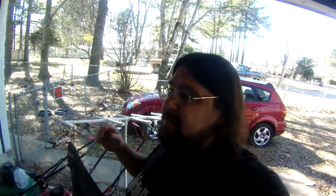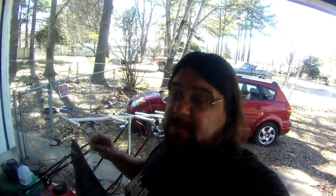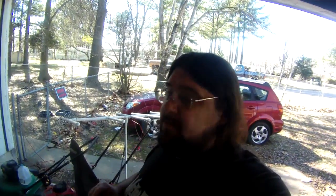Might be able to check it again, might not, but I know that I'm really close anyway, and the SWRs are fine, 1.5, around 145 megahertz, no problem. So we're going to go ahead and make it a little bit better, though, just for a good match.